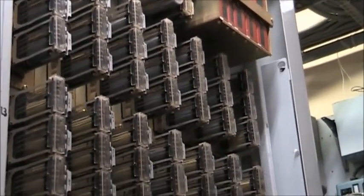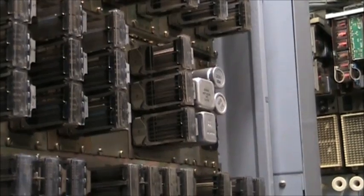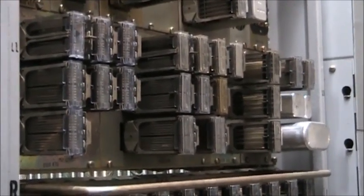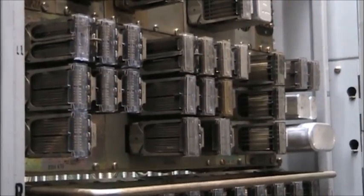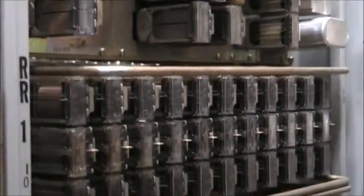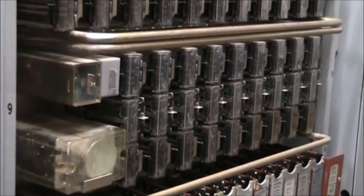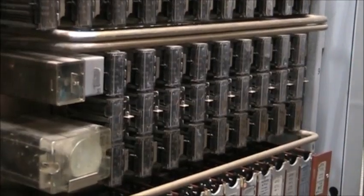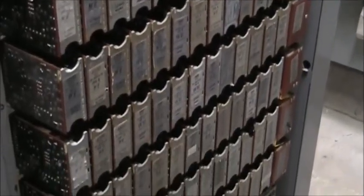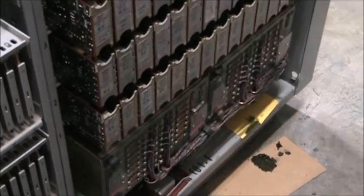Below it are various KTUs — most of them 227 series — for auxiliary services and control. I also have a conference circuit, a tie line circuit, and then below that the concentrators, which connect to 18 or 30-button telephones with only a small cable going into them. These are connected between the telephone and the KTUs. Below that is some 1A1: a 239 panel and a 238 panel. Between these two panels there are 20 lines of wire spring relays. Below that are the 584C panels — approximately 105 lines, 8 times 13. At the very bottom are the power supplies that run the equipment in this bay.